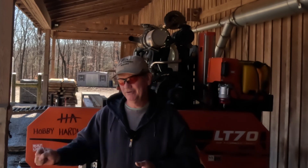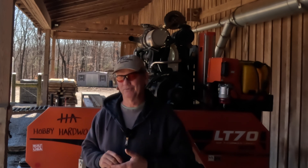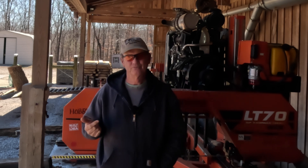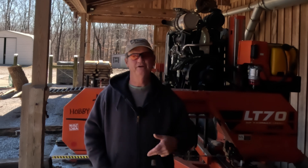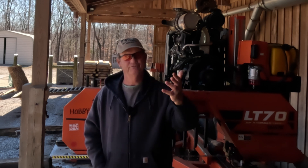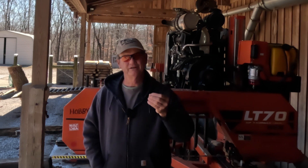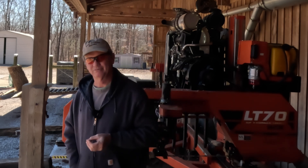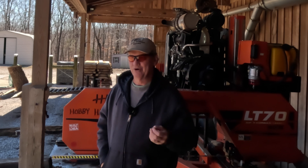Pack sawdust like flour and you're not going to cut straight. What you want is almost no sawdust on your boards — if you watch my videos, you'll notice I talk about that often. Most of the time I'm sawing North American hardwoods, and I like seven-degree hook angles on pretty much everything I do. Wood-Mizer makes three different types: a frozen hardwood 7, a turbo 7, and a 747 — all seven-degree attack angles but with different gullets. Cooks likes an 8. Is there much difference between an 8 and a 7? Probably. I can feel it, though I don't know if everyone can. There's certainly a big difference between a 7 and a 10, or a 7 and a 4. You should be able to feel the degree of hook angle at some point in your sawmilling career — like knowing whether a guitar is in tune.